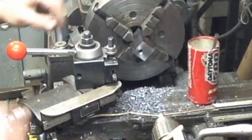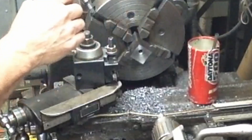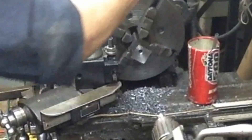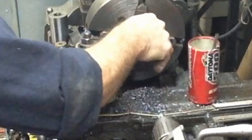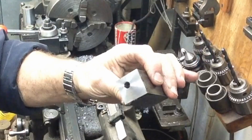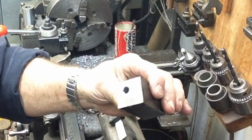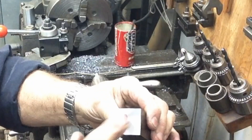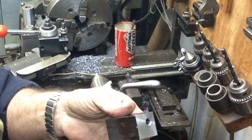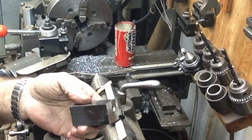And that's all there is to that. Drilled it, bored it, faced it off, and then just countersunk it. So this is actually the bottom — all this is going to do is define the shank area and where we can cut off. So let's take it back over to the milling machine now.